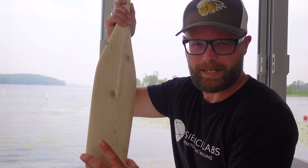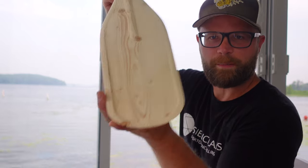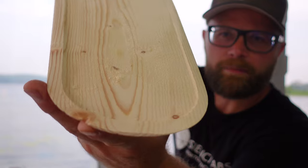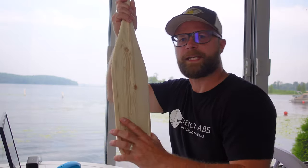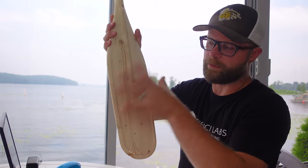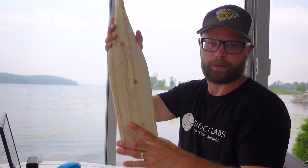They were kind of wimpy. And this is what happens when you use wimpy tabs. See wimpy tabs? Skinny wimpy tabs can come back to bite you. What happened here was I had some skinny wimpy tabs on it, and while it was cutting out the 3D model, it went through the tabs to the point where there was nothing left.